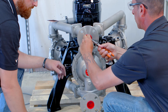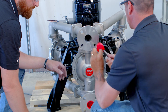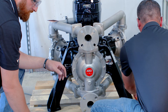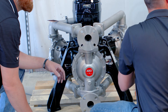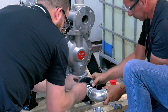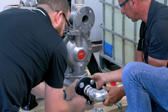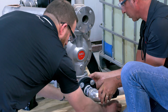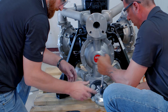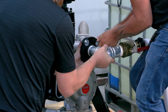Based on your pump size, the ARO EVO series pump can accommodate an ANSI or DIN flange. For piping installation, use flexible piping connections to limit loads on connections. For fluid section pump material made of aluminum, cast iron, or non-metal, use only flat face flanges to connect. Either flat face flanges or raised face flanges can be used to connect to a stainless steel pump flange only. Select a low creep gasket material if possible.